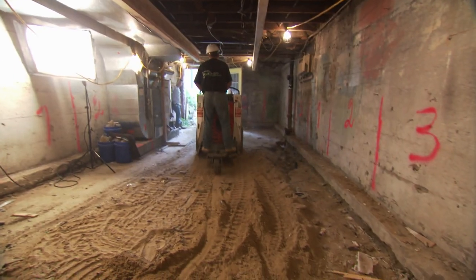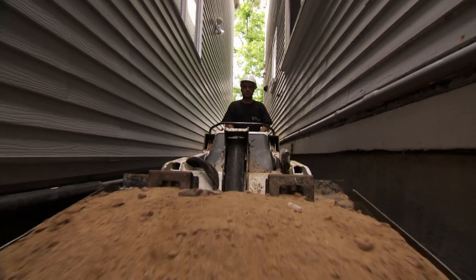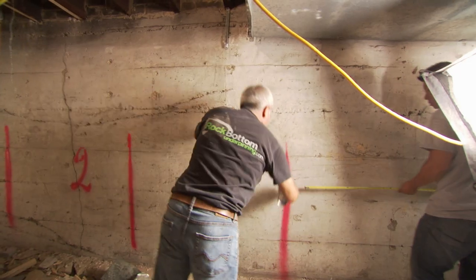Taking all the sand out is a big job — it's tedious, it's heavy, and it's a lot of manpower. We'll then dig out underneath and re-pour a new foundation wall down to a new footing, one section at a time, and we will be left with eight-foot ceilings and a finished, structurally sound shell.